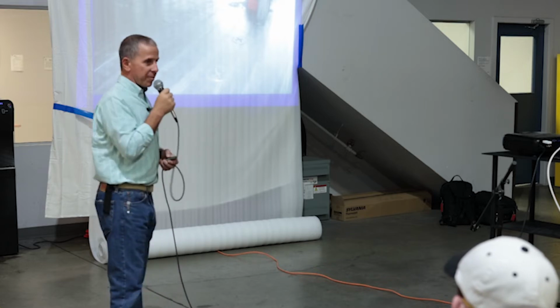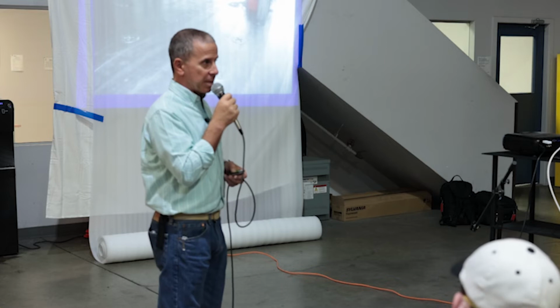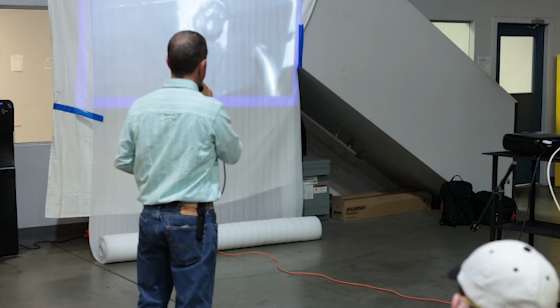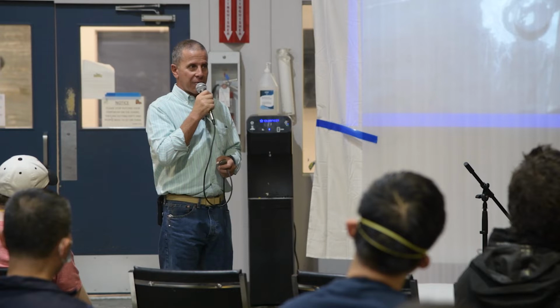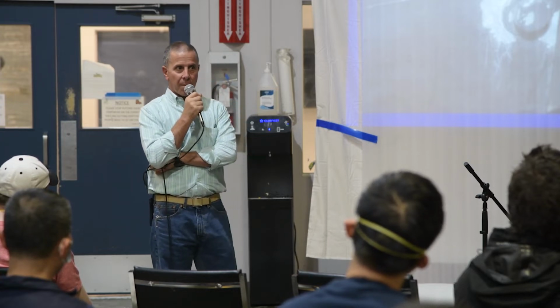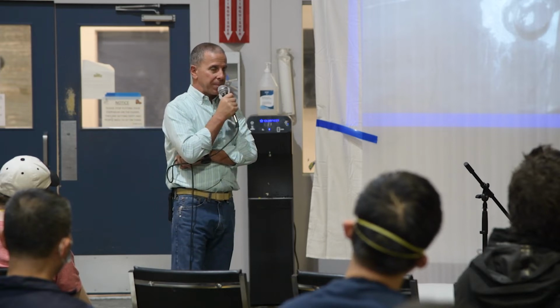So a lot of military vessels, the inside of the vessel that is aluminum is not painted, again, because it doesn't need to be, simply adding weight and expense. Now, if we paint an aluminum structure and then add fasteners to the mix, that's when things start to become problematic. And again, I know that's what goes on here every day, that we can't help it.